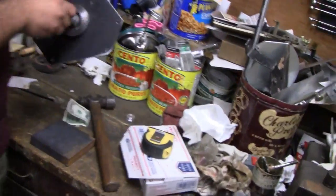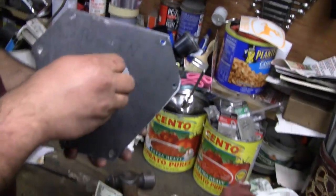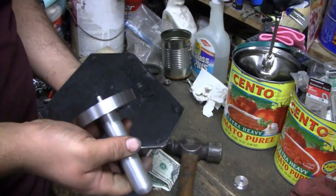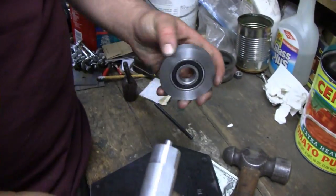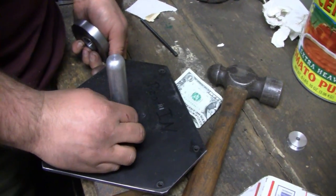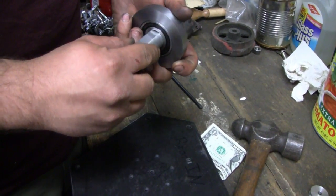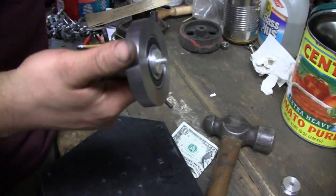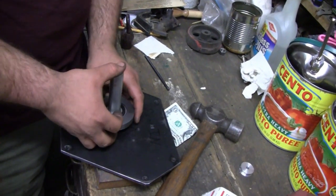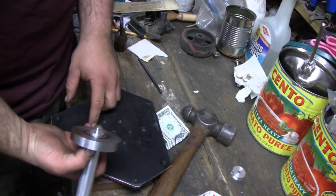Let's go check and see how Mike's doing. This is the little spindle I made to hold the bearing. How tight is it? It's pretty close — it fits in there pretty well, you've got to get it lined up just right. You've got to get the bearing straight or else it won't slide on. The concept is that it holds the carrier in position while I punch all six of these dots.